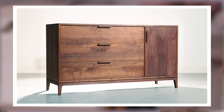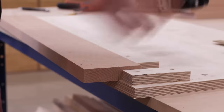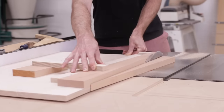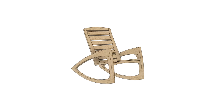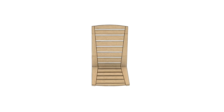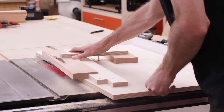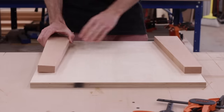Go check them out and see what you like. It might not be totally clear at this point, but so far I've started by building the seat, which is probably one of the more complex parts of this piece. I wanted to accomplish a few things with the design of the seat: I wanted it to be comfortable enough to sit in without cushions, I wanted it to look just as good with or without cushions, and I wanted to give it the look of a contoured seat without having to do any wood bending. So I started by first making the seat side pieces, which were tapered, then used those as my roadmap for sizing and fitting all of the seat slats.